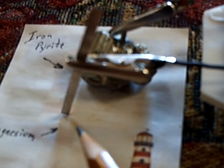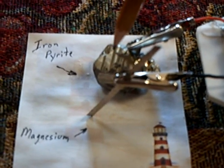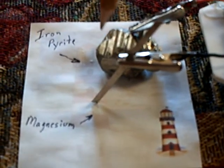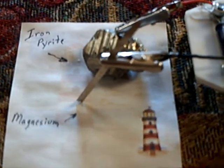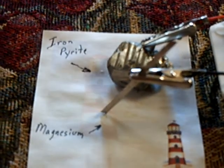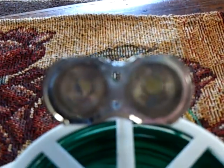And that answers a few things: you do not need a lot of water to make a galvanic situation happen. There might be something going on with the diode characteristic of the iron pyrite — this will work with just copper, but it works better with that iron pyrite. And that may be what we're noticing: we have better galvanic cells using the semiconductors. But this is galvanic — nothing more than a galvanic reaction. What is interesting is the small surface area it needs to make this oscillator work.